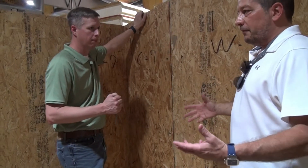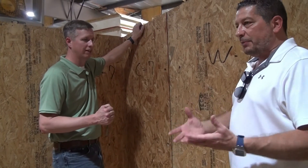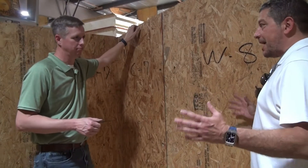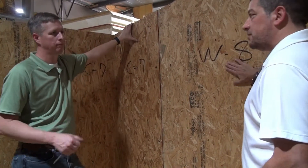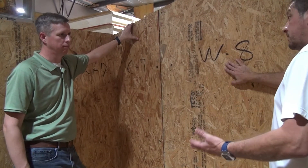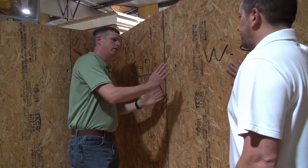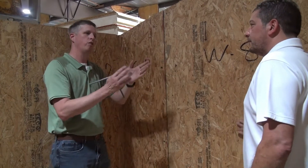This is your little mock-up of a space that would typically look how a space is going to look after panels are set on a job site. You're going to have OSB on the interior — and is that always going to be the interior? Typically it's always going to be. Part of the structural panel is you have to have two pieces of OSB, interior and exterior.